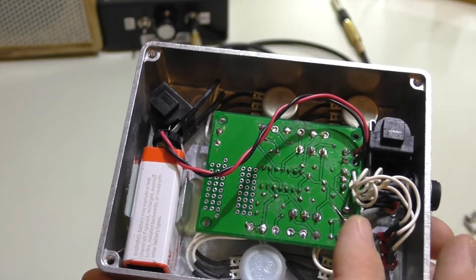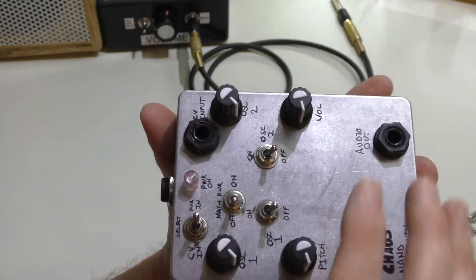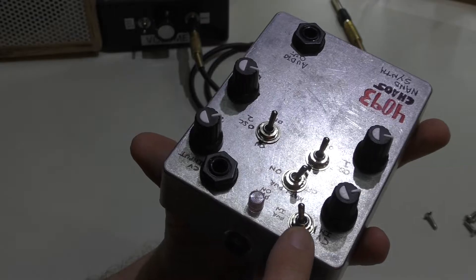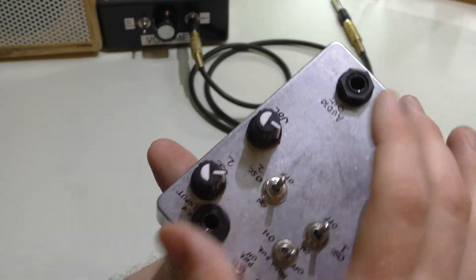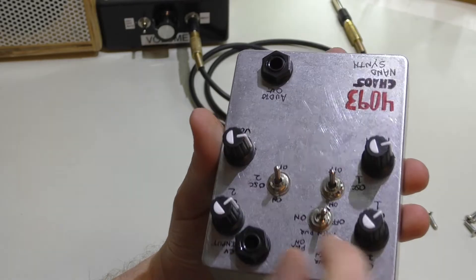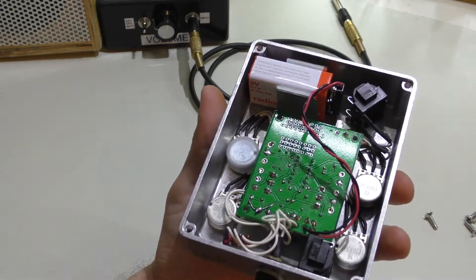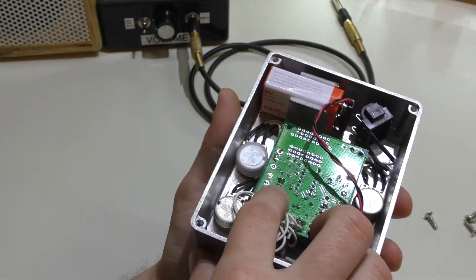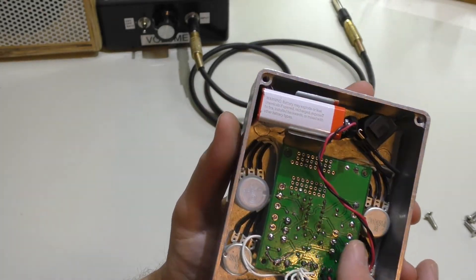You can see this trace right over here — it's got a bit of a bodge job on there. I just went ahead and soldered a little wire over the top of it to cover it up. It's really not a very complicated unit. To get this circuit board out you would actually have to take all the nuts off the front and it drops through the other side. The LED, CV in, the CV select switch, the four pots, and the audio input are all wired off the board — you can see the wires coming in the background. Whereas the three switches in the middle are actually soldered directly to the board, which is what keeps the board from moving around. You do have screws in the corners if you wanted to mount this differently.